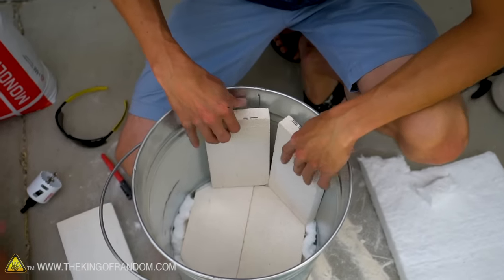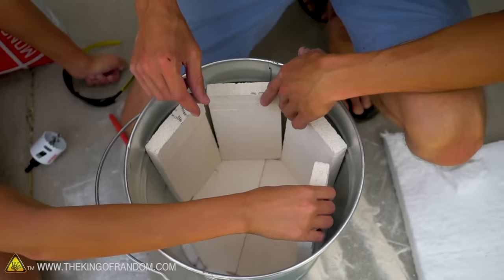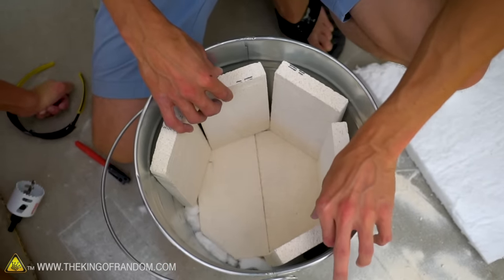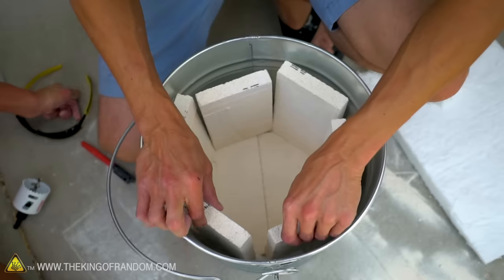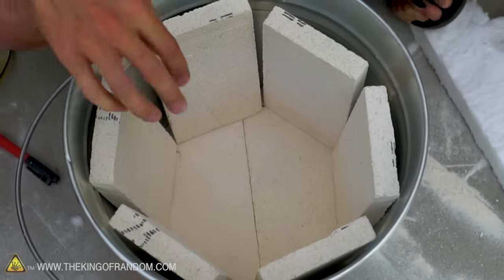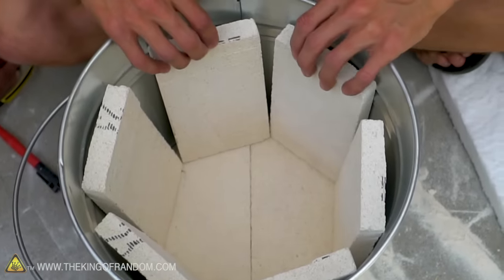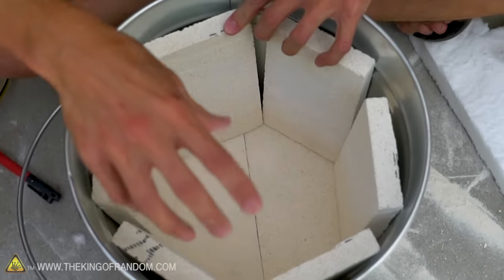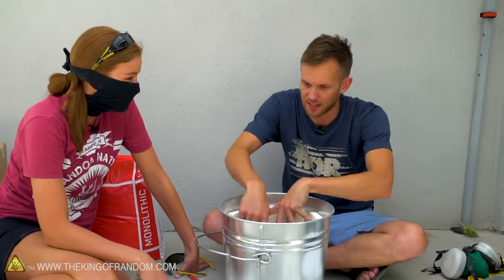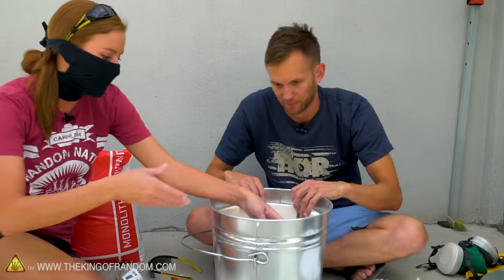As these bricks are right now, if I recall correctly we can't quite fit them all — but actually we might. This bucket might not be quite the same size as the last one. Wow yeah, we got them all — this bucket is just a pinch wider than the one we used before, so I don't think we're gonna have to cut down the sides of the bricks. That way these can even rest sideways a little bit and we'll have a lot more access to getting whatever we're heating down within. I think what we're gonna want is kaowool in sort of triangle slivers and then just a strip around the top and also in the section behind the bricks.